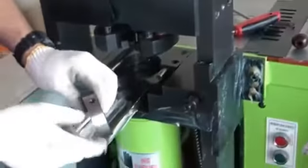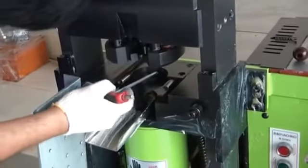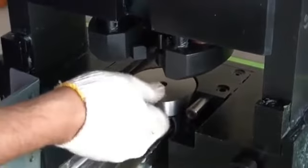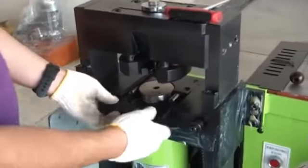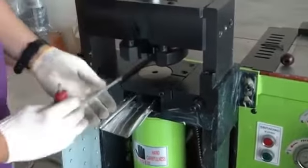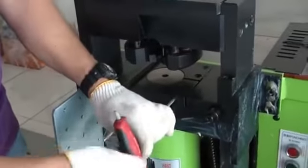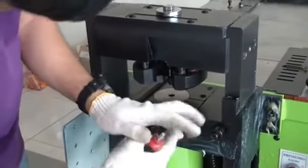die. This is the guiding hole, and we have also a guiding pin here, spring type. Okay, especially this is used for the oblong position, to get the correct position of the die, especially for oblong. Okay, so this is the die lock. Our die lock, we have two screws. Okay. Easy to fix. This is more safe, because it is locked by screw.